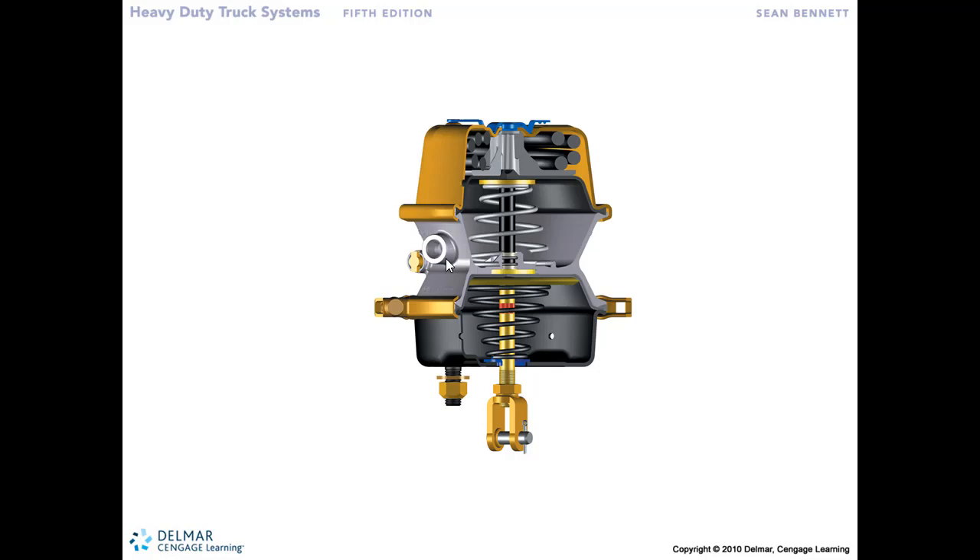So that we can release the park brakes — with the spring expanded and no air pressure in there — you would loosen up the nut and take that caging bolt out. You can see the little lugs on the end here; it's almost T-shaped. It has a nut with a threaded rod on it. We would remove the blue rubber plug off the end of the brake chamber, and then the caging bolt would fit down through that opening.